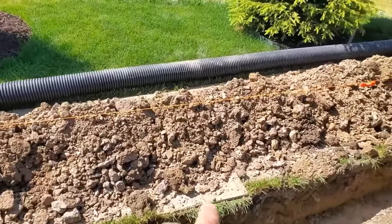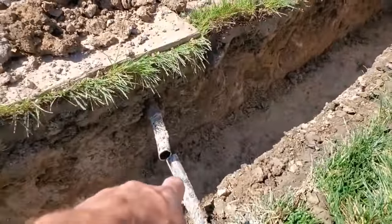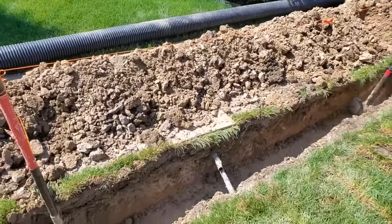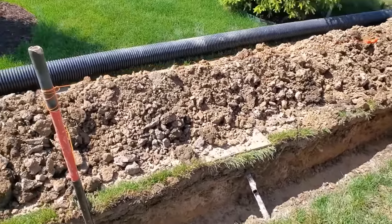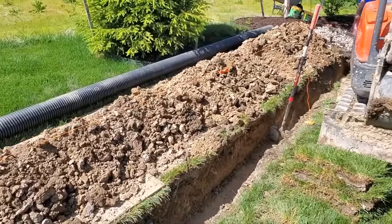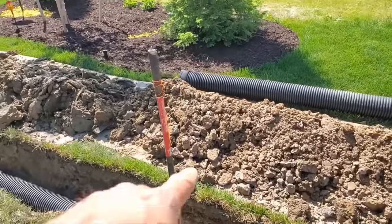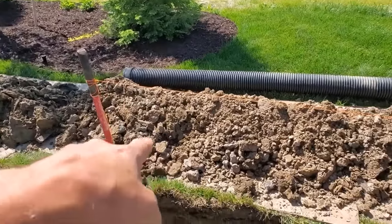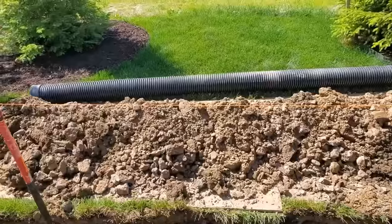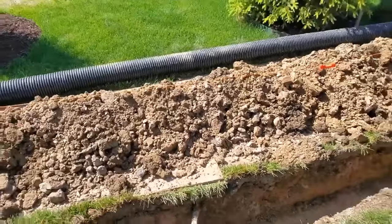As you can see, we work on plywood like we always do. When we get this in, we're going to mend the sprinkler line — we just cut those, get the system in, put couplers and clamps. When we leave, it looks just as we found it. Here's a nice DIY point: if you're slowly chipping away at a system, buy a few pieces of plywood. It makes it dirt easy to shovel off and you can move it — do a section at a time, maybe 200 inches at a time.